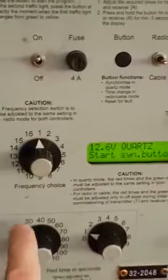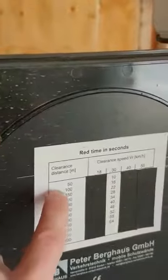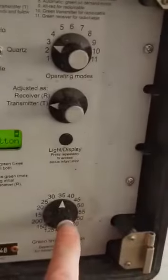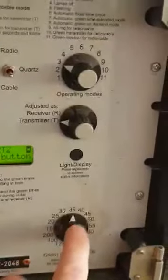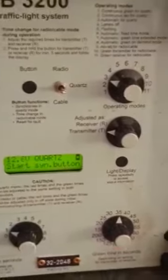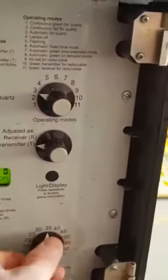And obviously your settings for the distance down the bottom is based off that chart, so whatever this is is what you do for these ones down here. And then this will be your fixed green time — so on quartz that's set to 35, it'll stay on green for 35 seconds and go back. If there's not much traffic you might want to move these down to whatever you want.